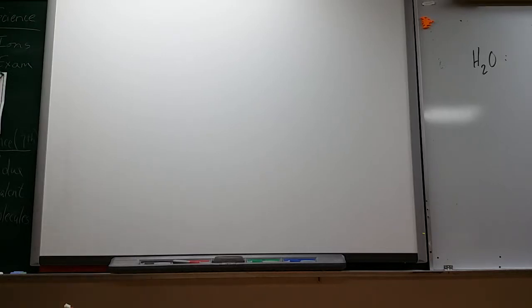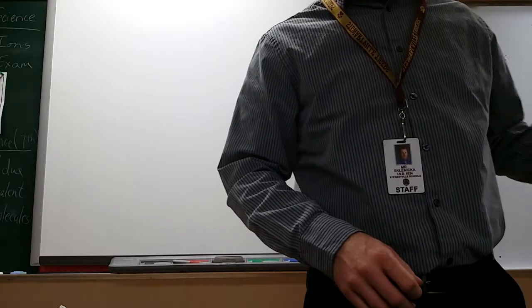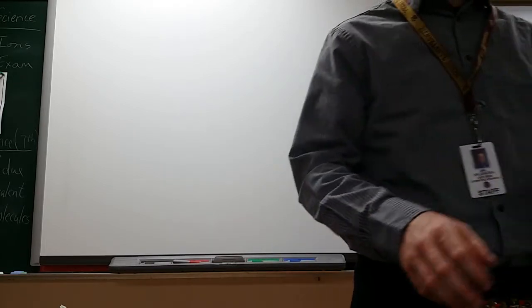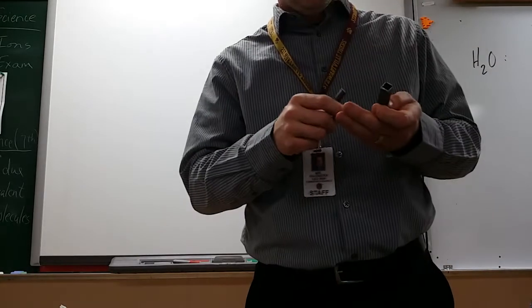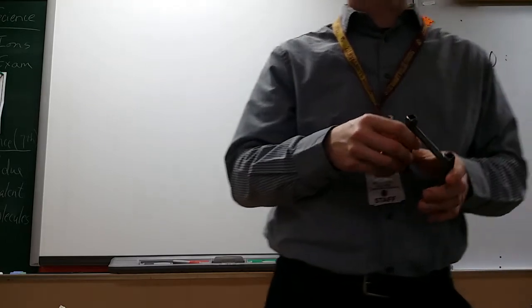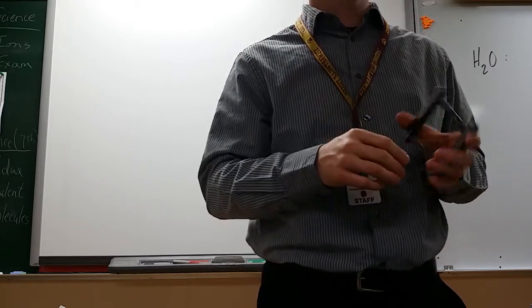Okay, a short time ago, but with all of the students missing, it seems like longer, we talked about Lenz's law, which dealt with inducing magnetic fields and electric fields. Specifically, when we had a changing magnetic field, a magnet going towards a coil of wire, that coil of wire would have an electric field and a current induced inside it that would create its own magnetic field to try and repel, or stop, the change that it saw. And that essentially is Lenz's law.